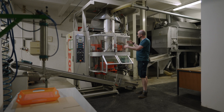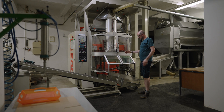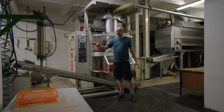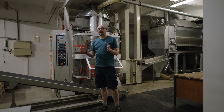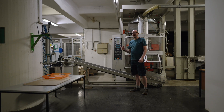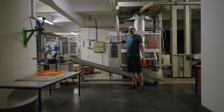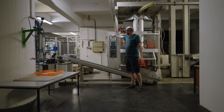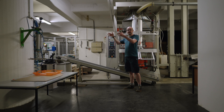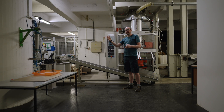This is the foil packaging line — everything is nitrogen flushed and packaged very professionally. This machine crimps every five kilos, checking the weights. The foil bag drops onto the conveyor belt, goes up, drops down, gets labeled, then boxed. Hop pellets are usually processed as four by five kilogram bags, though ten or twenty kilogram bags are available for different size breweries. The boxes are labeled and go into the robot palletizer, which lifts the twenty kilogram boxes and builds pallets for onward movement into cold storage and then on to the processing facility.